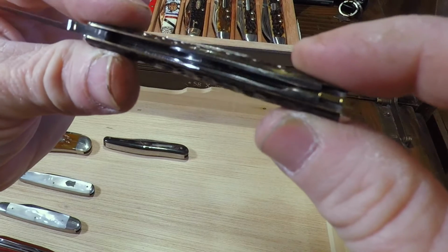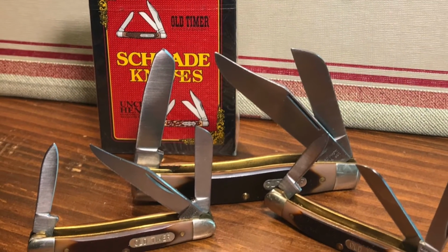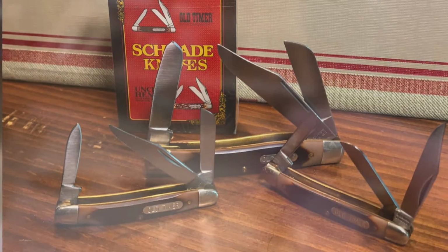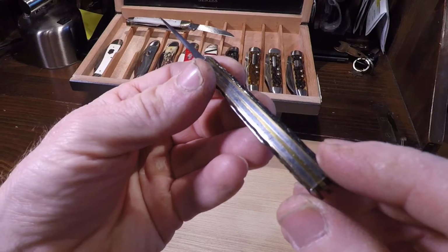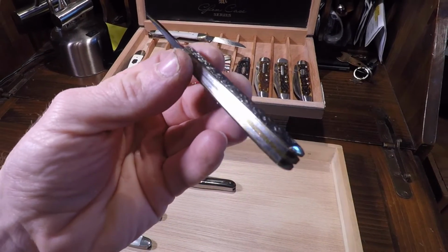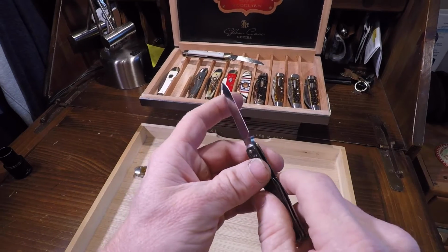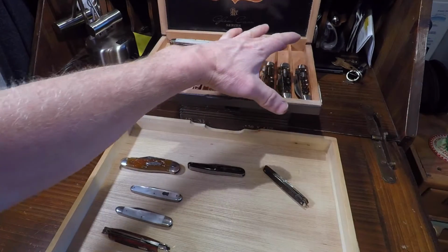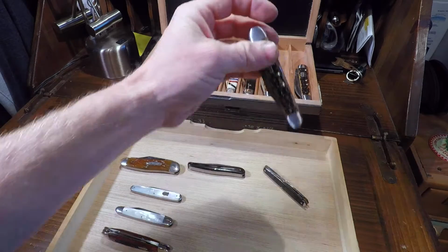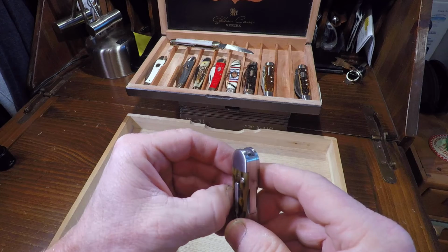Right. So instead of bending blades like you would do on maybe a Stockman, which is an easier knife to fit, here you're working with back springs, and it takes a lot to fit these. Whittlers take a lot of hand finishing. It's a difficult knife to make. Matter of fact, the Tony Bose knives over here were some of the more difficult knives that were made.